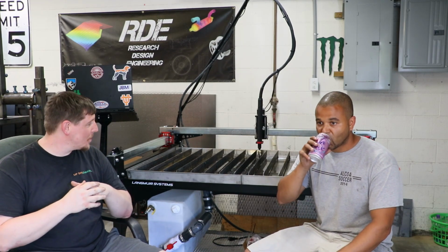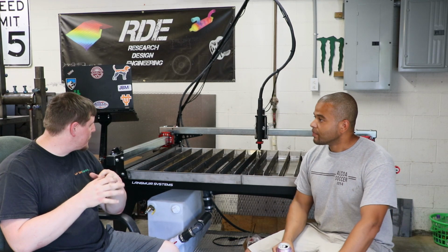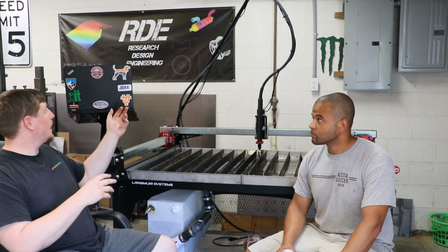Yeah, so one thing I noticed is when I was actually shooting video with the GoPro, the little gimbal we use started to freak out. It's probably because of EMI, electromagnetic interference, coming from the plasma cutter itself. It's a really high power, high current item. Puts off a lot of electromagnetic interference, causes electronics to freak out a little bit. Because of that, we're not 100% sure yet, but we think it also is causing some issues on the laptop we're using here with the laptop stand.